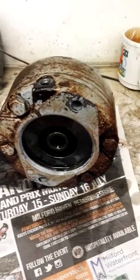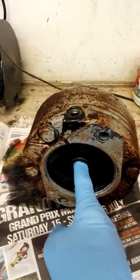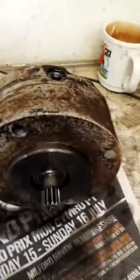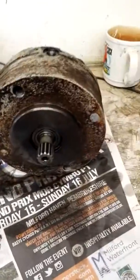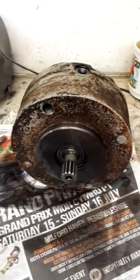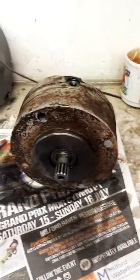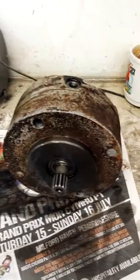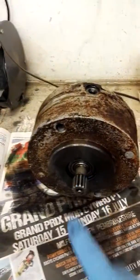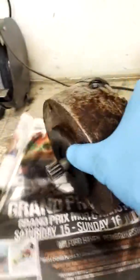This is one side — the side most inwards. This side has the drive from the hydraulic motor. The drive goes straight through out the other side into the torque hub. So although that doesn't look very big, because of the torque hub it doesn't have to be huge because there's a tremendous reduction — maybe 20 to 1, 30 to 1. A ton of pressure on there would put 20 tons of pressure on the road. So that's why they don't need to be gigantic — they're doing an easier job, a bit like using a crowbar.